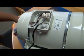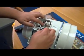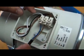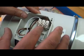That is your connection to the TD800: neutral to your left, marked with the point N, and live to LA which is the high speed of the fan. You don't connect anything to LB when you connect something to LA.